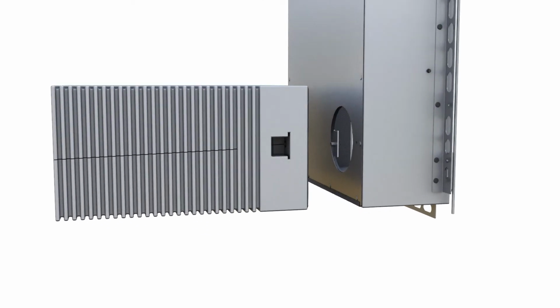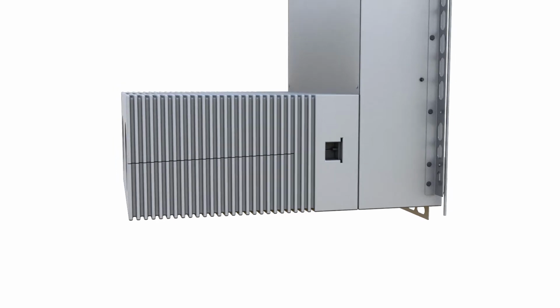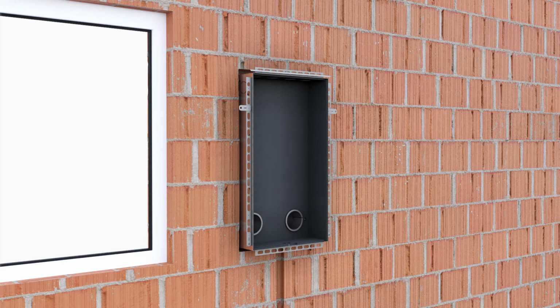For the electrical installation, a corresponding wall groove has to be milled out in the center of the wall aperture. Before the flush-mounted housing is placed into the wall aperture, the wall duct must be screwed together with the flush-mounted housing. The wall duct is provided with a slope towards the outside so as to prevent moisture penetration from the outside. The flush-mounted housing is fit into the wall aperture together with the wall duct.